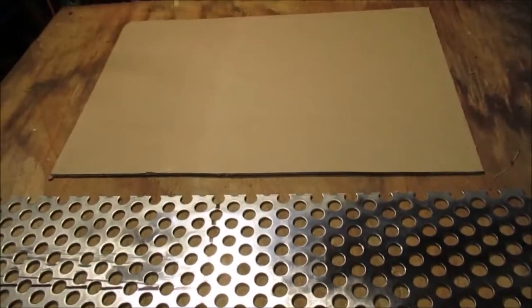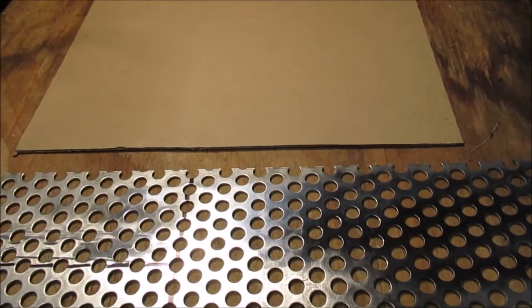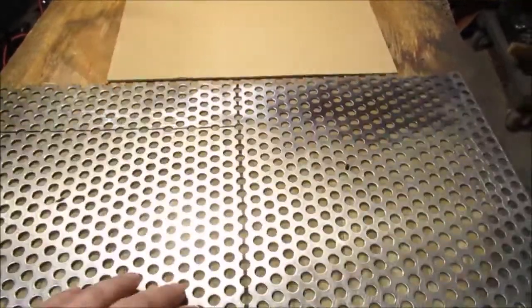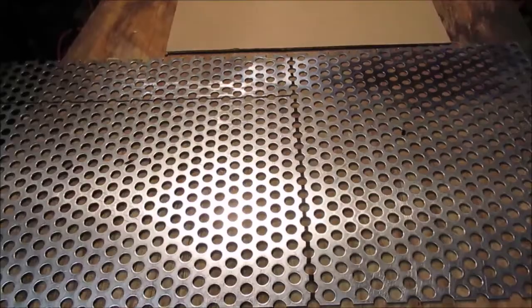So we're going to go outside and cut this with a thin cutter disc and a 4.5 inch grinder. And we're going to do it really slow so we don't snag and bend and twist something. This stuff's only about 70 thousandths thick, 65 to 70 thousandths. Off to do that, then we'll go show you how it fits down in the tractor.